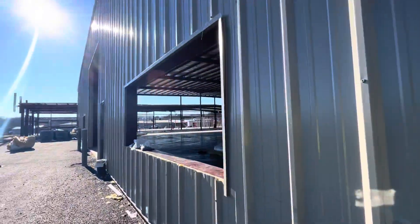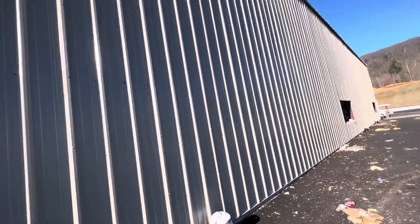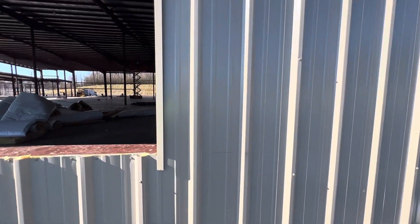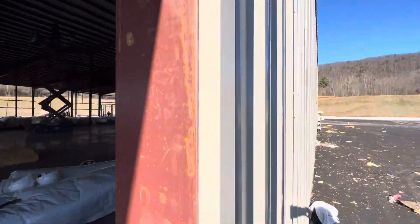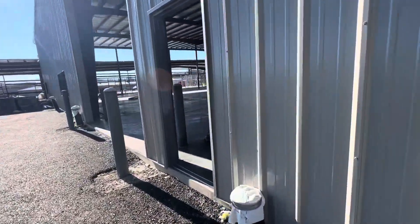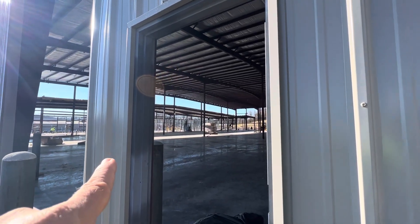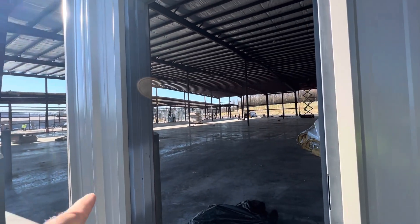Here I have a mechanical louver, and over there another mechanical louver. You can see the framing around the mechanical louver. And that will show you here — the man door. The important thing you need to know: you need to install the metal door frame first, and then do the metal wall panel second.